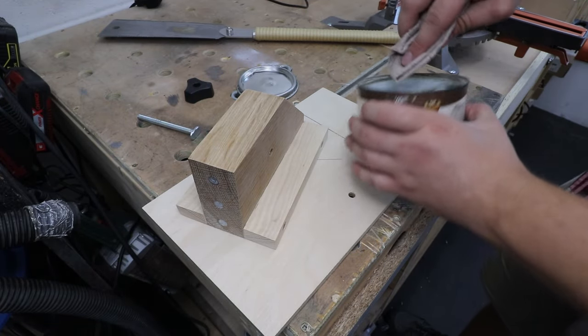Right, let's test the jig out. For example, if you've got a bigger board or a beam, grab the jig, place it on the piece of timber where you want to make the cut. You can hold it by hand or use a clamp to hold it down — that's why we've got the lip. Now we can make a straight cut with our saw on this piece of timber. And now we can see how square it is to that face — dead on square, perfect.